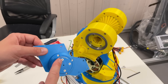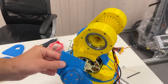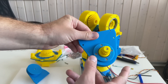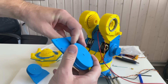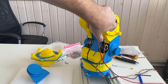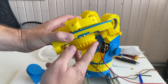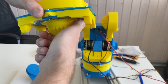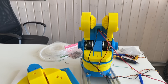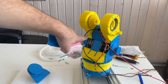This one should be fixed to the motor, and this should be fixed here and here, just like this. I've also assembled the sun gear with a big pulley — this will go over here — but before installing it I need to put the grease on the planets. And this is the assembly for the output, the big bevel gear, which goes just like this. So I need to install this, and then axis 2 and 3 is going to be finished.